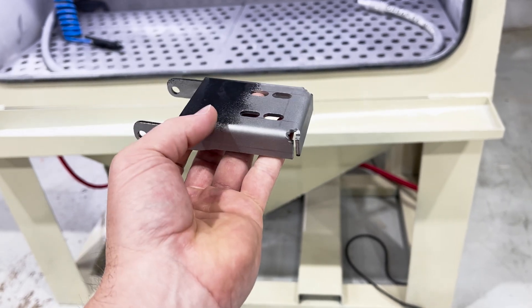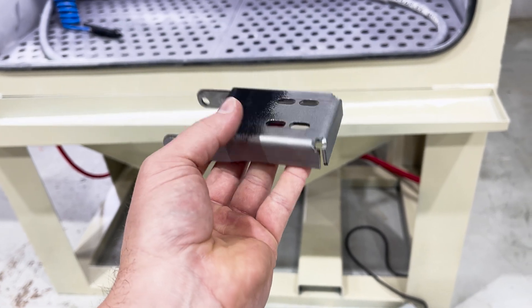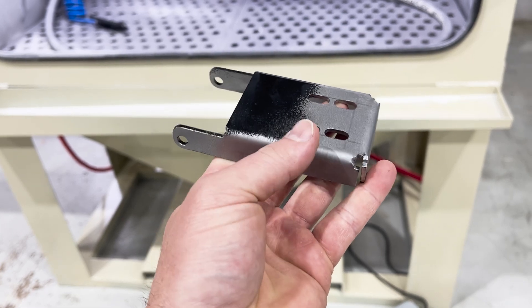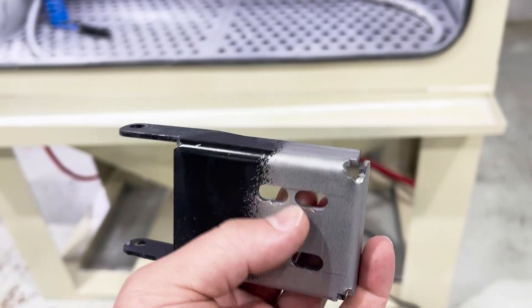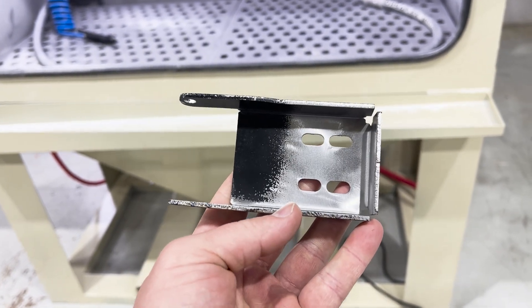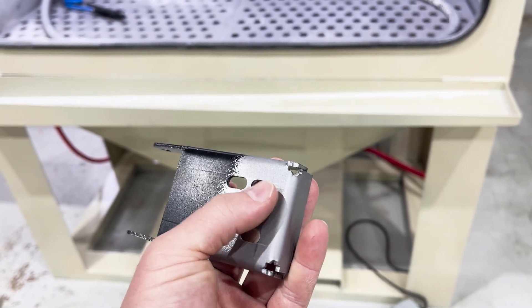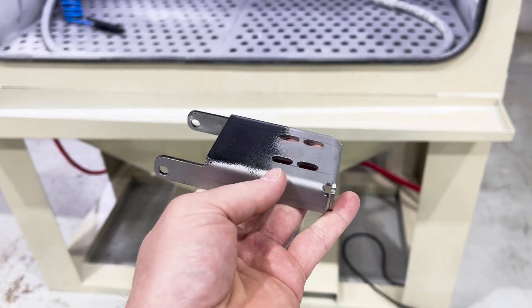This is a fabricated metal part that we make in the back, and we painted this part — not powder coat — and I just wanted to see how quickly it would work. The really interesting, awesome thing I noticed is that it's not touching or damaging the substrate like traditional blasting medias would in a wet blast or another dry blast cabinet. So if not damaging the substrate is a concern of yours, then dry soda blast would definitely work.